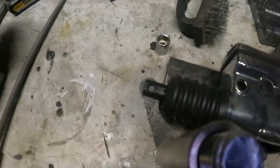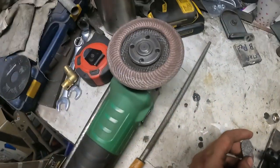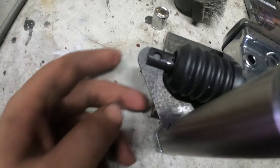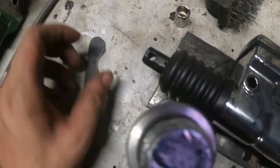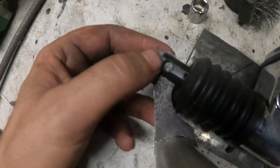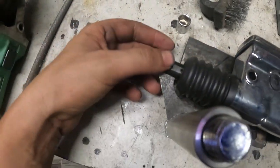So let me show you where I got so far. Right around here you can see this tab — ground down on the bench grinder and hand files. It actually slips right in there and connects right to the pivot point I'm making. Once it applies pressure there's still a perfect amount of gap — it just kind of rubs against here, it's not going to cause any damage. All that's left is drilling another hole right there, tossing the pin through — I think the pin is actually still on my original brakes.